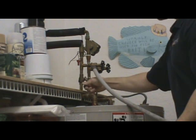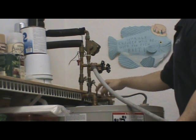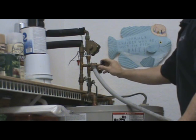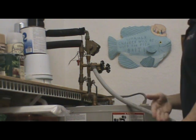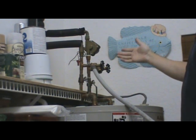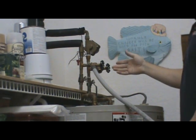We're going to go ahead and open this valve now — the isolation valve on the return line — and then we're going to shut the gate valve to stop water flowing out into your hose. Now your system is completely purged of air and is full of water.